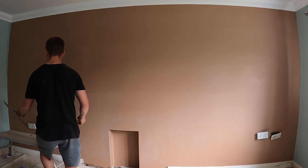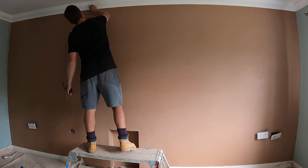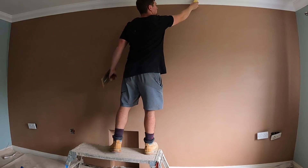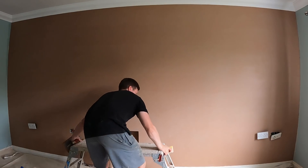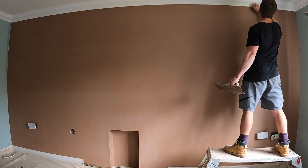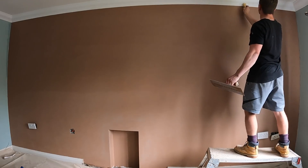This is more housekeeping: I always clean my edges. This is a finished room — the coving is in place, the walls have been painted — so I try to keep the area as clean as possible. I've got dust sheets down on the floor and I'm cleaning along the coving. You can use masking tape, but I prefer to clean up as I go with a sponge. I find it's a bit faster and it's just good practice for anyone trying to make a good reputation for themselves.